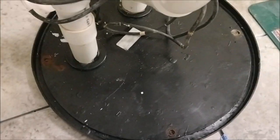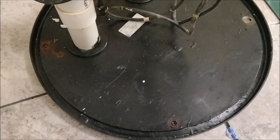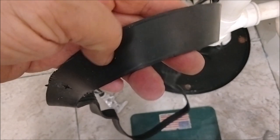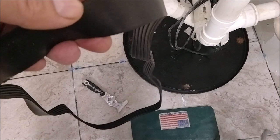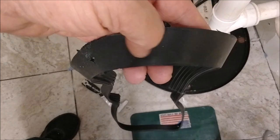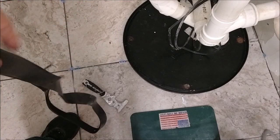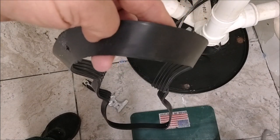If it doesn't work, I can also use silicone as a last resort. If you look at this rubber, you can see there are two sides: one is a rough side and one is a smooth side. I'm not exactly sure which should be on the bottom and which on the top, so I decided to put the smooth part facing the cover while the rough part faces the sump pump. When I attach the cover and tighten the bolts, it will squeeze the rubber and seal the sump pump properly from bad gases.